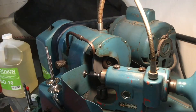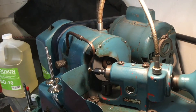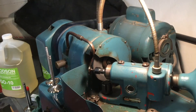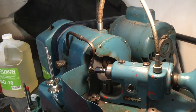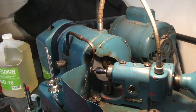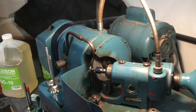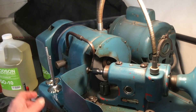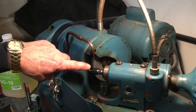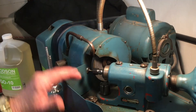Let's get the wheel going and come in to a nice proximity. The valve had a little irregularity on the surface at first, but now it's cleaning up all the way around. Let it spark out, remove it, turn the machine off, and have a good look at that finish — that's a really fine finish all the way across.